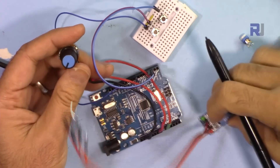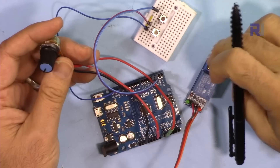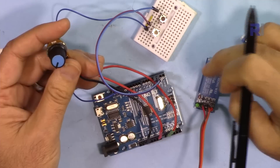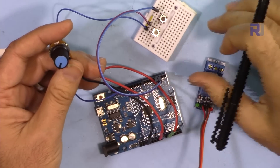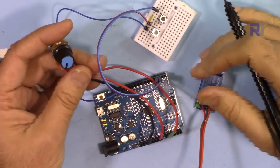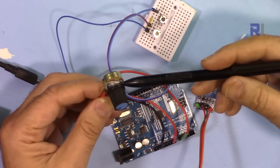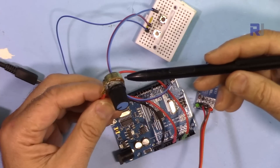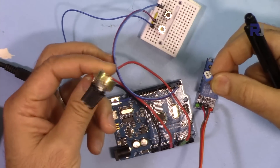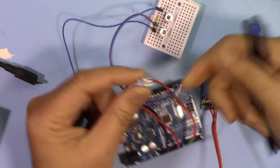In this video we're going to use Arduino as a timer to control a relay and consequently to control a DC or AC load. To set the time, instead of needing a computer or screen, I'm using a potentiometer. You can use any potentiometer from 1 kilohm up to 100 kilohms. If you don't want a large potentiometer, a tiny 3-pin potentiometer also works fine.